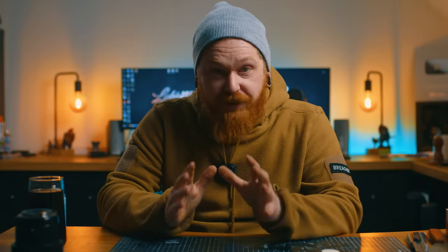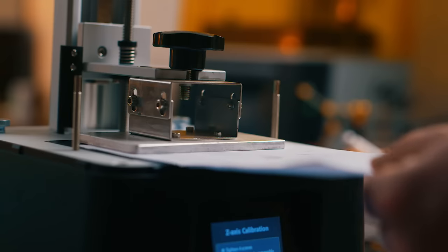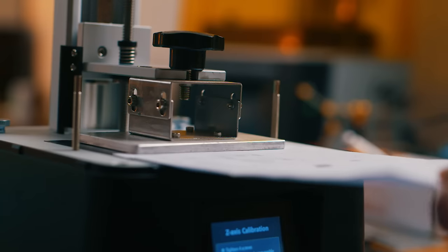Make it so all the bolts are tight and then while you've still got that pressure on, go back and give it the final tightening. But make sure you do it the same on all four corners — if you do one more than the other there's a chance the build plate might shift a little bit. Once you've got the bed level, that is one of the biggest things that causes most of your issues.